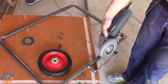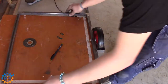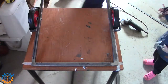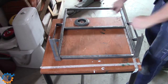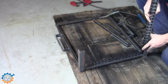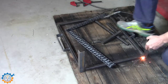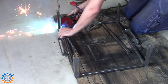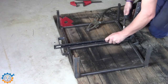Test mounting just to make sure that everything fits, and then I weld the first one into place. To the front I have these angle irons mounted, and the middle support is just to carry the weight in the middle of the bed.